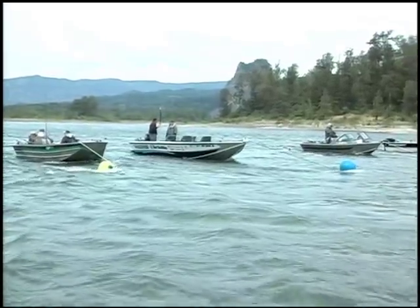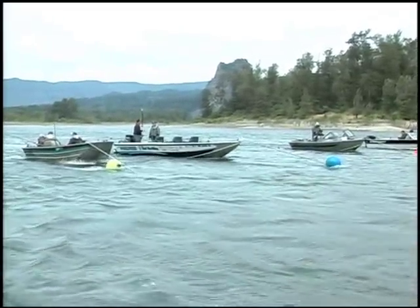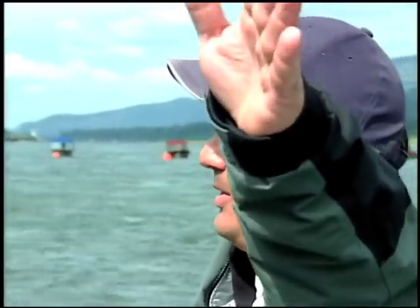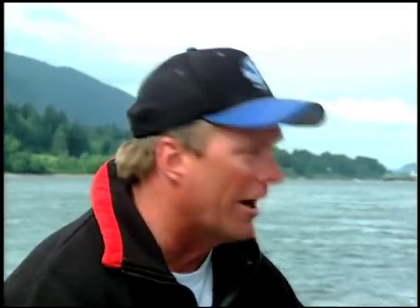I run my tiller with my left hand so I like to pull with the ball to my port side so I can watch it go — I can see the rope off the corner of my boat. I just pull out around the ball, keeping it to my left side, and motor up an imaginary line parallel with the rope that's already in the water. Since we've got boats nearby, once I get the rope up I don't want to cut the motor and try coiling the rope in because we'll start moving back down river right on top of them. We're going to pull up and then I'll pull it right out into the big river so I can slowly just bring it in. The key is making sure that your anchor is all the way up so you're not grabbing these anchor lines as we're going across.